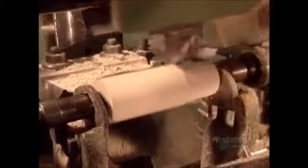High-end shovels and spades have what's called a steel D-grip, a steel handle grip with a wooden insert. An automated lathe first shapes a piece of ash to the right length and profile. Then an automated drill pierces a hole.